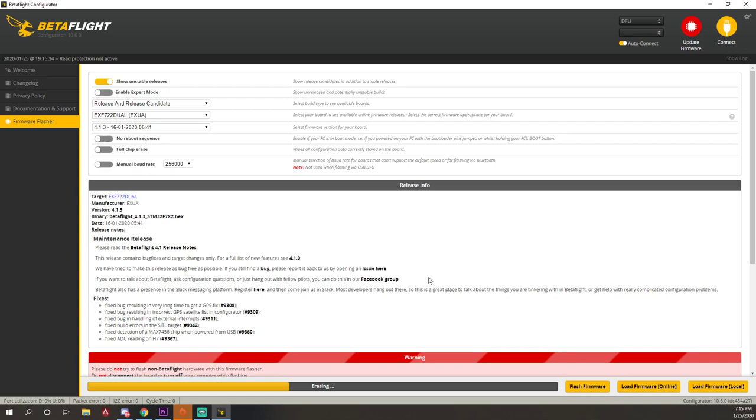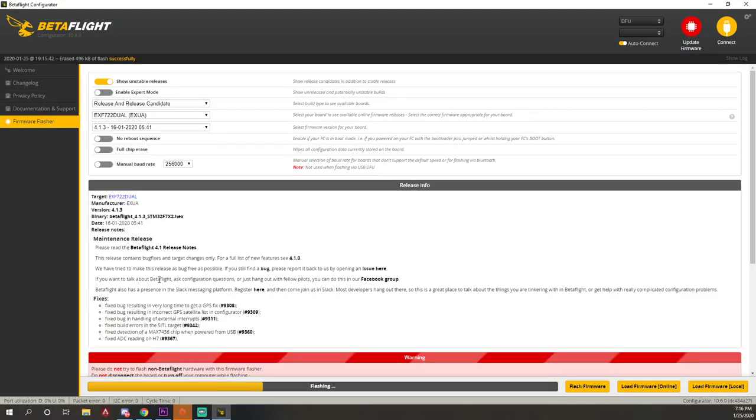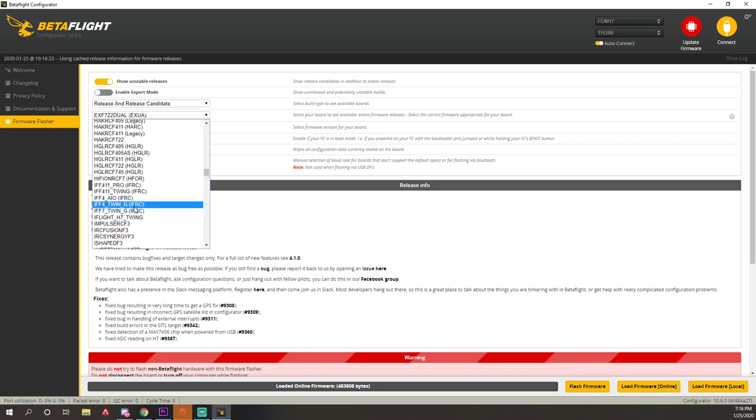Actually, they have it under iFlight. Oh shit, go where? Oh, I guess I am delayed right now. I wouldn't do the STM one, do the iFlight one, because it's gonna have the default settings right when it loads up. Okay. So it's gonna be called IFF underscore twin underscore G, parentheses IFRC. Okay. I'm a little behind on the stream. So I'm about to reflash her. Okay, iFlight. IFF seven underscore twin underscore G. Yes, that one.